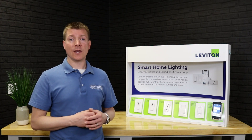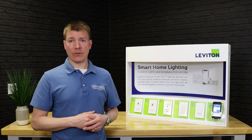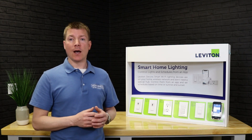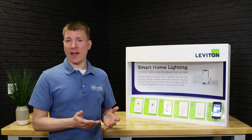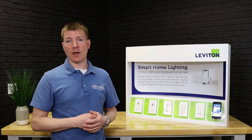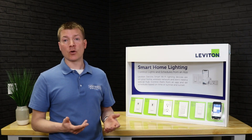What's really cool about that is it scales very well, especially on smaller systems. If you think about a hub-type system where a customer wants one or two devices for outdoor or pathway lighting, the price of that hub divided over two or three devices adds a lot to the system. In a Wi-Fi setup like this, there is no hub to divide over those devices, so your cost per device — especially on smaller systems — is quite a bit lower.